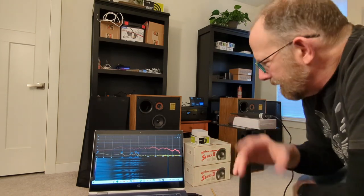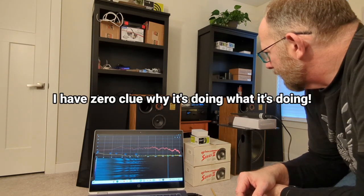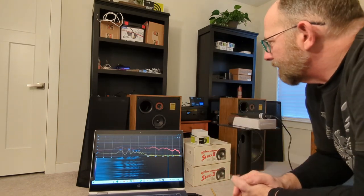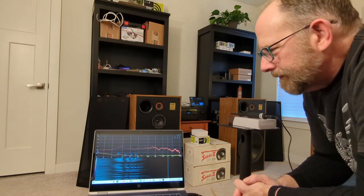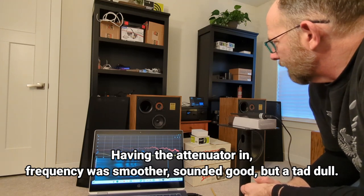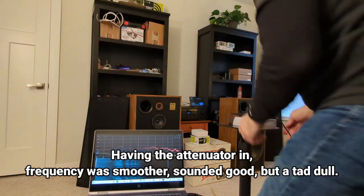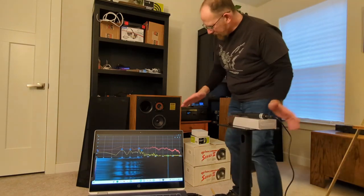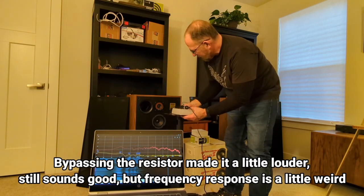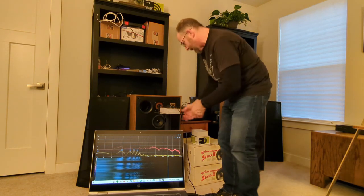So this could be just an anomaly from being in an open environment, and the mic itself, maybe it's picking up weird angles or something like that. But the only way to know 100% for sure what that tweeter's doing is maybe move it right up next to it and see what it does. We could actually do it with all the drivers. But if I had my choice, I would probably just leave it like this. I'd take the little bit of extra sound pressure there compared to any little bit of smoothness it may have gained.